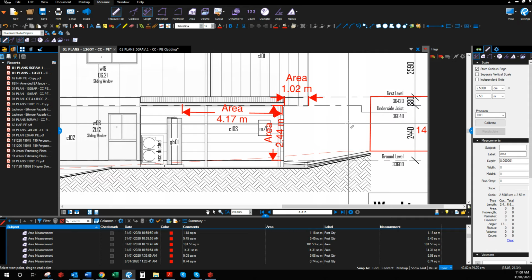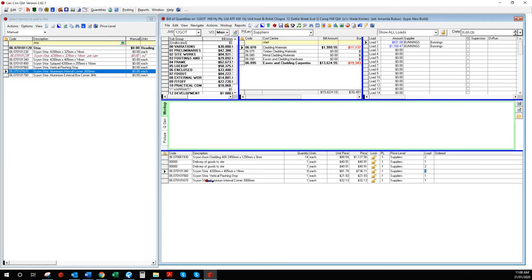that was 7 boards at the front. So then we're going to do 7 plus we can do half a board here and use the other half here, half a board here, half a board here. So we can do just like 11 boards will be enough to cover that area. So then we go back in here to 11. Again, we're going to need a vertical because we've got a join between those. So we add another one there, and then we don't have an internal corner.